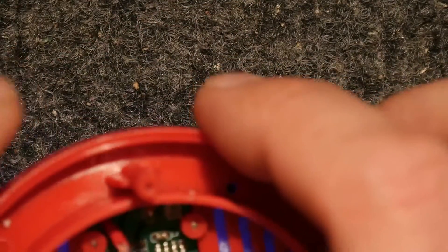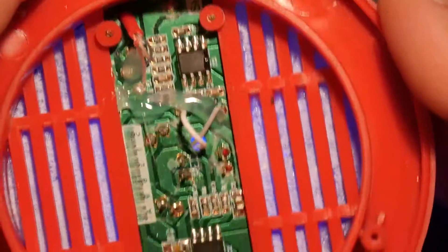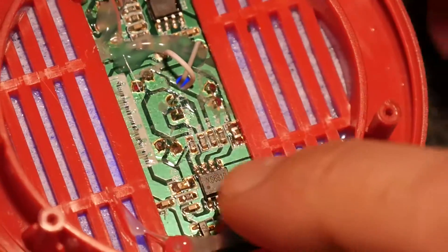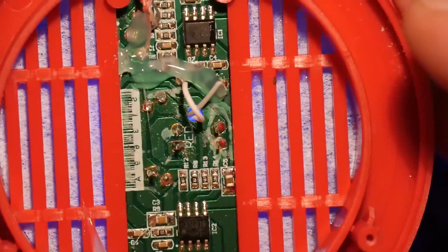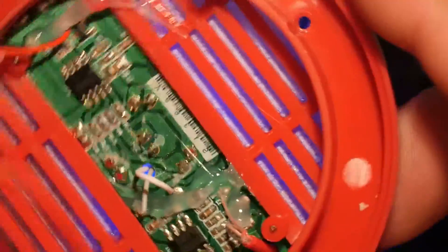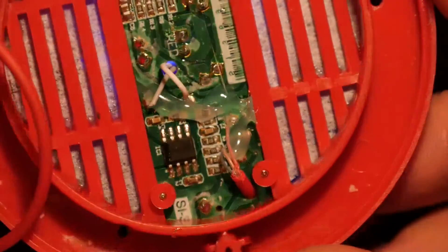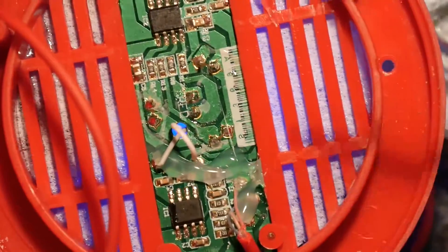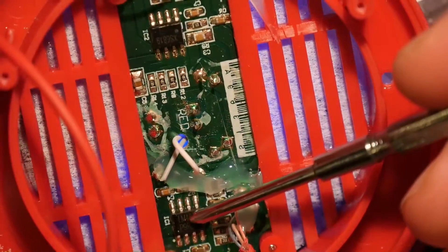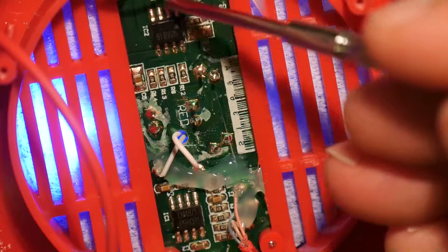Let's flip it over. I don't think we actually have to get the PCB out to see what's going on - we've got a good chance of figuring this out. So that's an XS6819. Let's see what the other chip is - an LM4871. Now I don't rightly know what this is because some of these LM things are power regulators, voltage regulators, something like that.